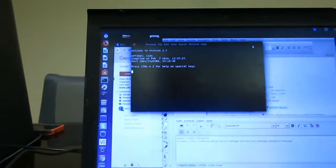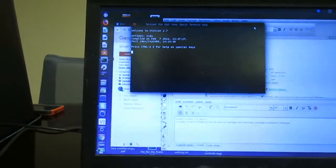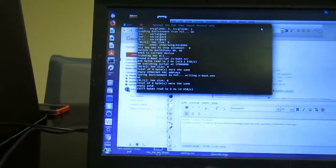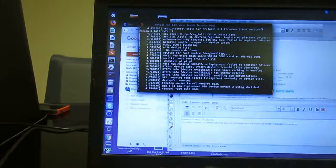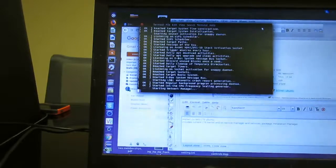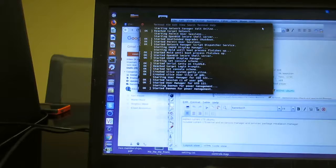We're going to watch the console display as we turn on the computer that has the Ubuntu image in it. These are the initial bring-up messages from the operating system. The graphical user interface doesn't turn on until the boot process is nearly completed. So if anything goes wrong during the boot process, this UART connection is essential to understand what went wrong.